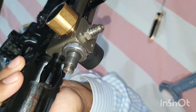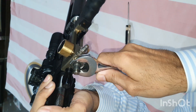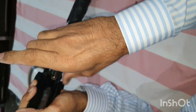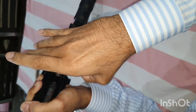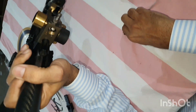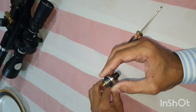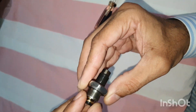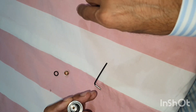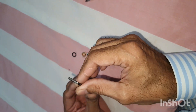We start from the main connector, which is also the first regulator. This is a bit tight, and you can see the plenum air is not coming out. So see what is here inside - it's an o-ring, and this o-ring sits here on this collar. Then what else is here - you would have seen in the videos of some other guys. I remove this screw and I remove this adjuster screw.